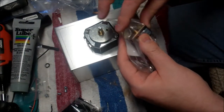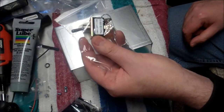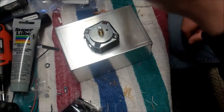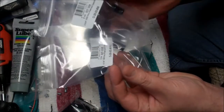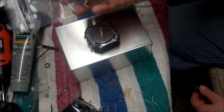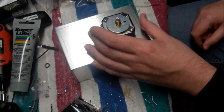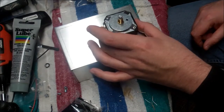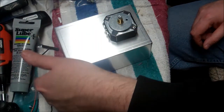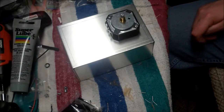We're going to be putting in a bright switch for attenuation. When you have an attenuator, it can roll off the highs, so we're going to use this on-off-on type double-pole, double-throw switch. And then I have two capacitors for bypass of the various frequencies. And then we have two jacks for input-output. So basically, first thing we're going to do is just mark where we're going to put our components. We'll put our L-pad like here and our bright switch there and our two input jacks probably out here on the front or something. Just mark that and drill the holes. I don't think that's too exciting, and then we'll come back.